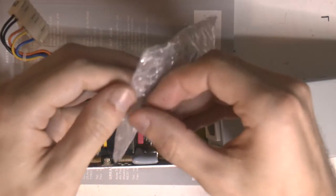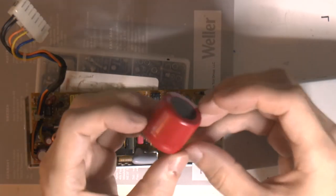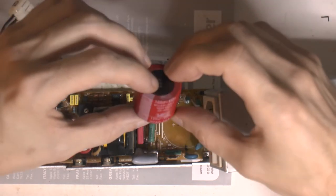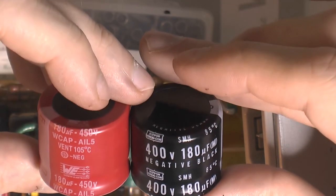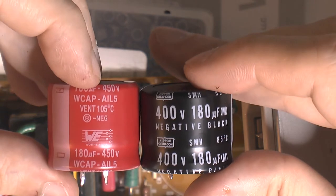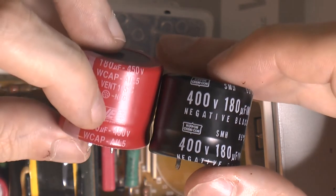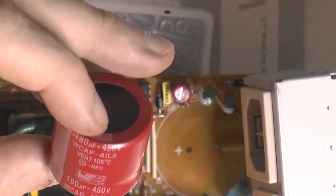Let's compare old and new. Apparently the new one is a little bit taller — I hope that doesn't hurt. Both are 180uF. The old one is 400V, the new one is 450V — that's fine. The old one is 85°C rated, the new one is 105°C. Hopefully it won't hit the top of the case. So that's the cap in place — let's clean it a little bit. I'm going to inspect it and put it back together so we can try it out. Not to forget the hot glue — we need to fix this in place.